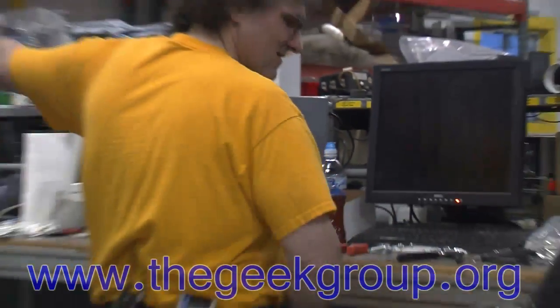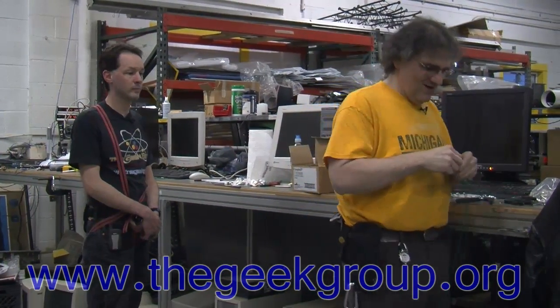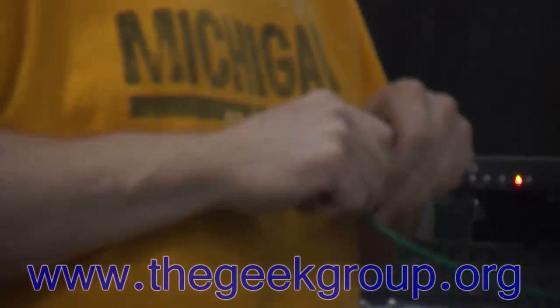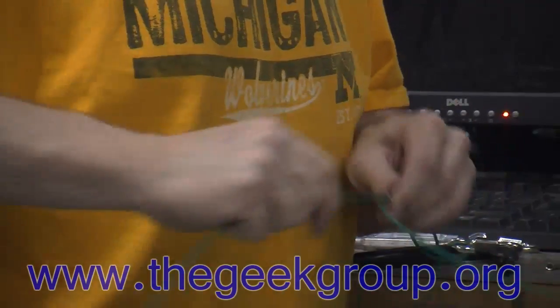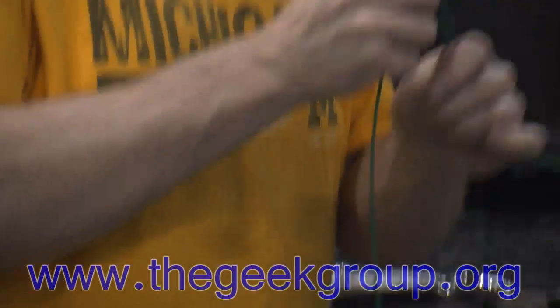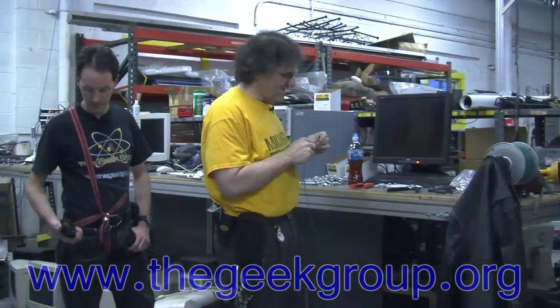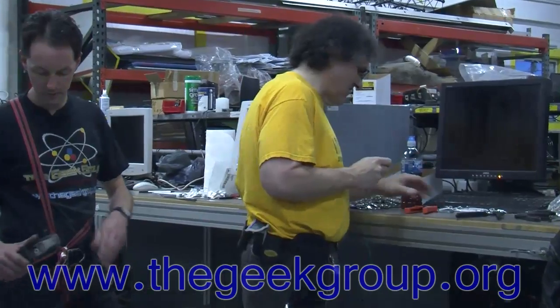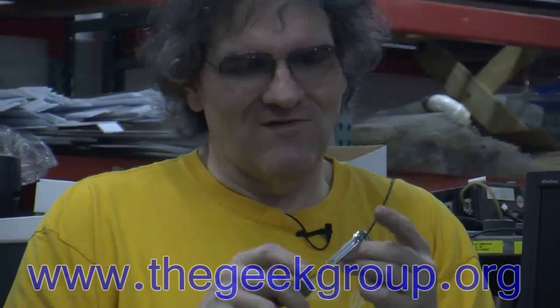I'm going to put a loop down on the cable so we can use the minimum length wire. We're not wasting any from one to the next. That'll be the bowling ball end in a minute. Another ferrule for the top. And we have turnbuckles with quick connects up here. We're using a thimble to hold the loop of the wire consistent.